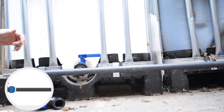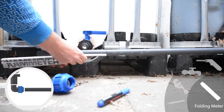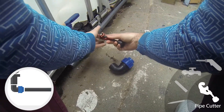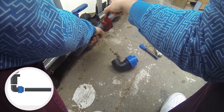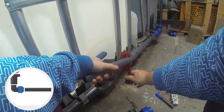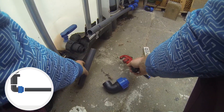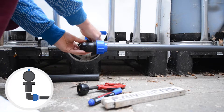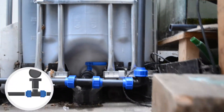It will be necessary to cut the pipes to the right length. Let's assemble the fitting to the pipe to know how much of the pipe will reach inside and measure the distance after. About 6 cm of pipe will be inside the fitting, and if we add this amount to the pipe, it will be close to the length we need. We cut the PVC pipe with this specialized clamp, which tightens around the pipe and will tighten a circular blade that cuts into the plastic when the clamp is rotated 360 degrees. Since there is no movement in the fittings, it's best to disconnect the drain connector, since its thread is not attached to the valve and can be tightened without rotating the piece itself.